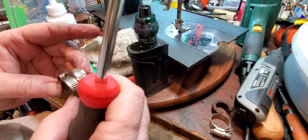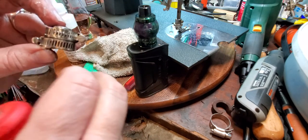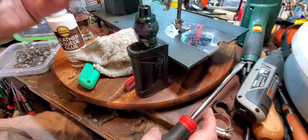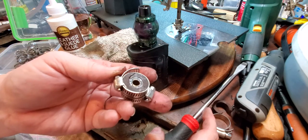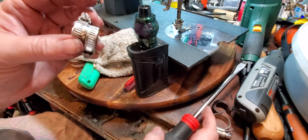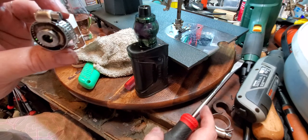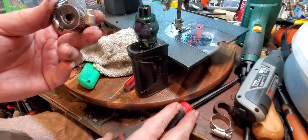And so there'll be these little indentations in the leather once it dries. And then I'll just put the pulley back on the motor and take a sanding block and sand down the leather. Just takes a minute. So that is how I put new leather on